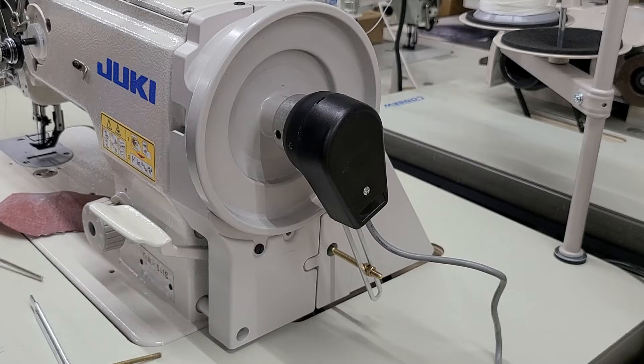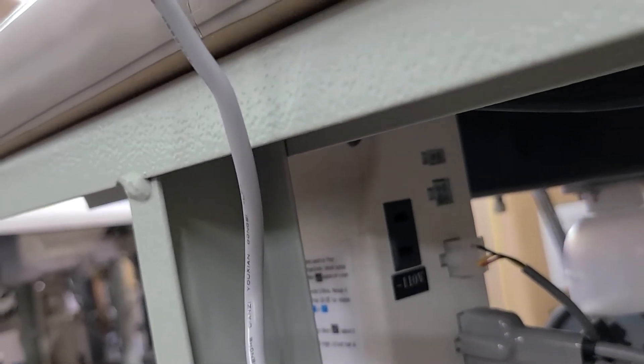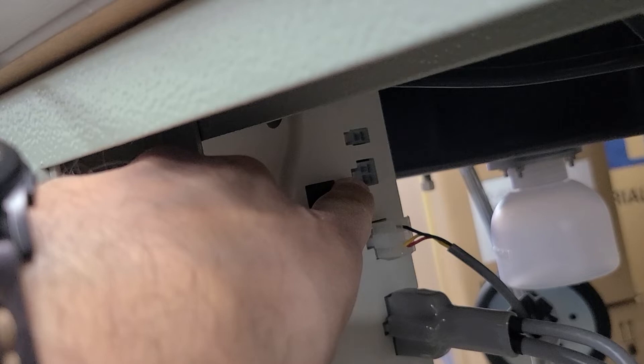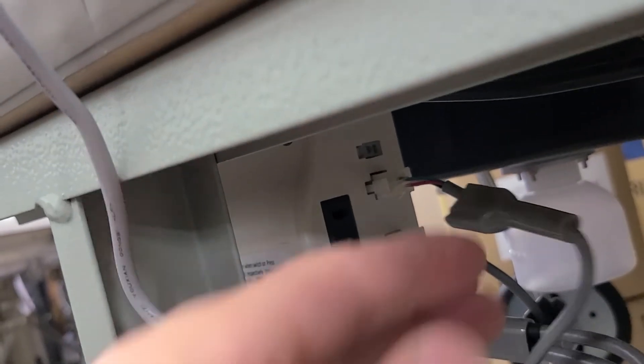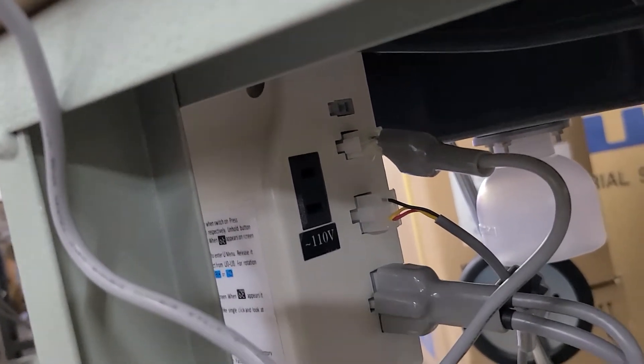Now that I've tightened that, I'm going to have to turn my motor off, and then I'm going to plug the needle positioner in. I'm going to reposition the camera just to show you where to plug it in. When we look under the motor, there's only one spot this piece can go because it's four pins here, and there's a four-pin right here — not the two-pin. So we're going to plug it into the four-pin just like that. You could put that piece over it too.